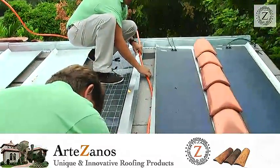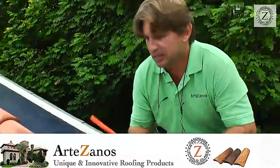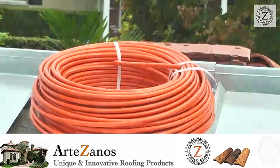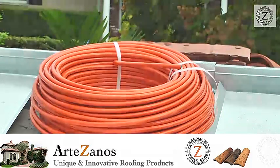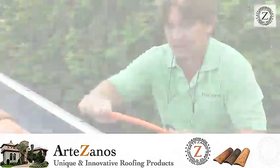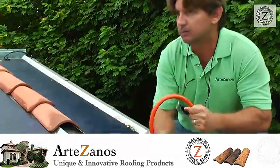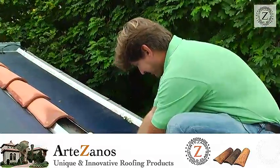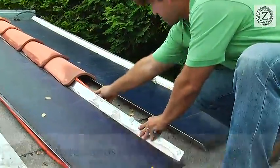It won't be exposed to the elements, it won't be sitting outside unsightly. That's very inexpensive — I got this roll of PEX tubing off the internet for a hundred and fifty dollars, five hundred linear feet. Awesome stuff. You can bend it. This actually replaces copper tubing, and you can weave it throughout the entire field area at your leisure and then install a tile on top. Basically, you get a free hot water system.